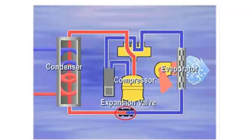The cooler, drier air is circulated back into the room with a blower fan. The refrigerant moves into the compressor, a pump that raises the pressure so it will move through the system. The increased pressure causes the refrigerant to heat to roughly 120 to 140 degrees. The hot vapor moves into the condenser — the underground loops — where the refrigerant gives up its heat to the cooler ground and condenses back into a liquid. The refrigerant then reaches the expansion valve where the pressure is reduced, and the cycle is complete as the cool liquid refrigerant re-enters the evaporator to pick up room heat.